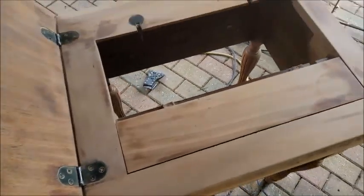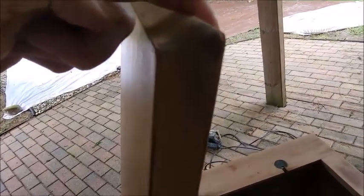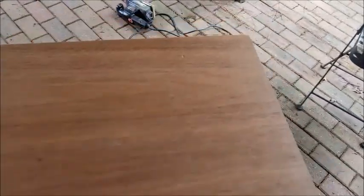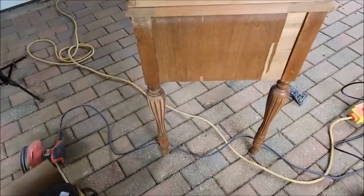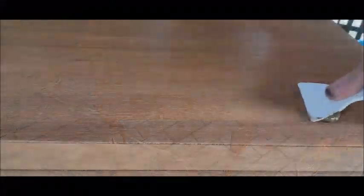You can find those types of sanding pieces like rad pads, and if you've got hook and loop you can use them or just use them plain. This thing was in overall pretty bad shape. I didn't think I was really going to be able to go through that veneer that much — the gouges and scratches were so deep that I probably would have burned right through it. So I'm taking it down enough, and I can see I'm probably going to have to go ahead and spray this with some stain blocker.